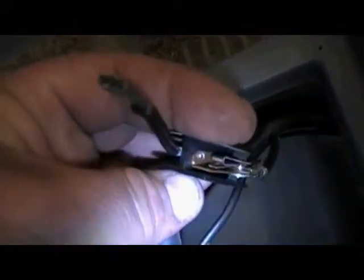But this appears to be some kind of really open breaker system. It's got a set of points on either side. You have one wire going to this thing, another bridging across, and I guess when these tabs get hot they separate and it shuts the motor off. And I would imagine this thing would start to carbon track after a while, and this thing would probably melt.